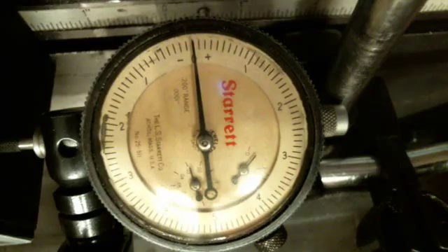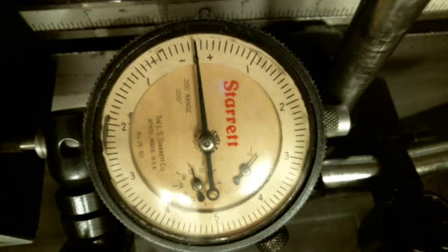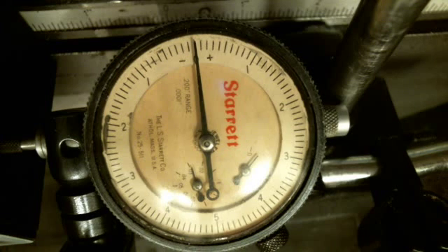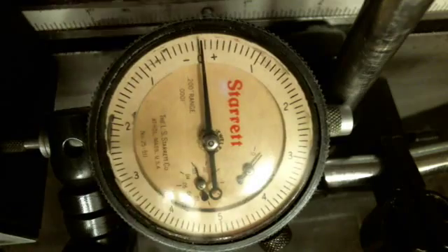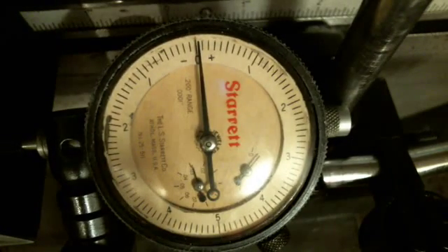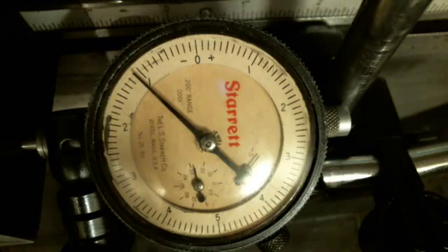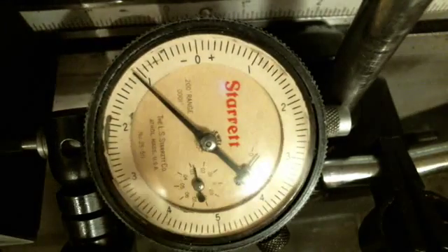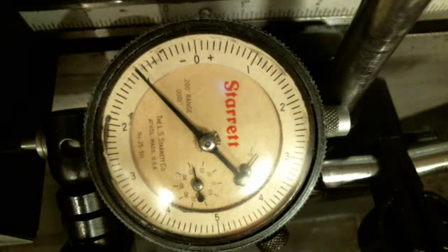The gib is actually putting force and causing it to have more backlash. I went too far — I'll have to knock it back loose. Now I want to check the backlash again to the left. If you notice, I had to move further. So let's say I had one thousandth of backlash before when I hit two steps. One, two — still at one thousandth backlash.